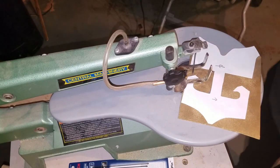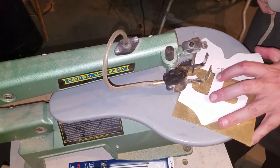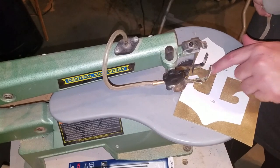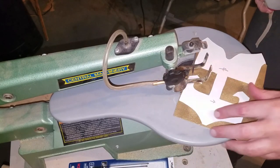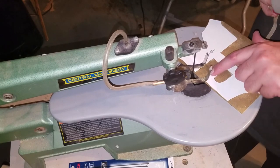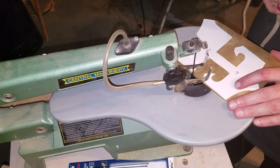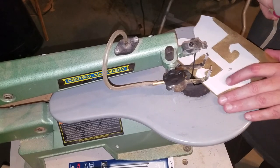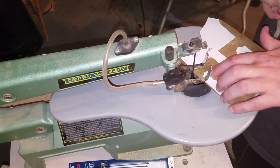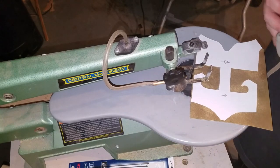All right, mask on one more time, and what I'm going to do is start guiding the edge this way. I'm going to turn the piece, forcing it out of the edge with enough width that I can rotate this piece inside of that little channel here. Because this is metal, I can't just find a new attack angle and cut it, because that'll wear out the blade prematurely, and this will help it last longer because I'm not making such a long cut and travel distance.